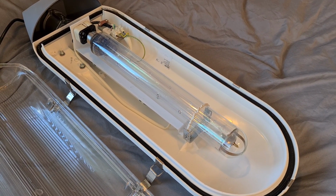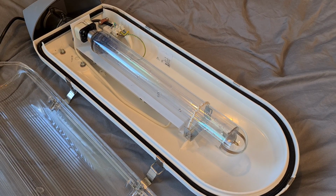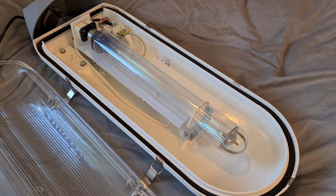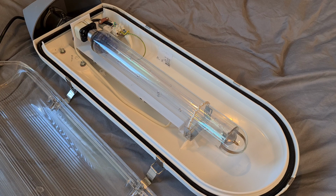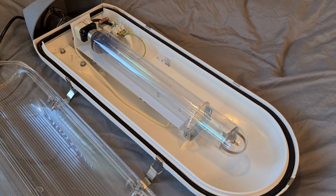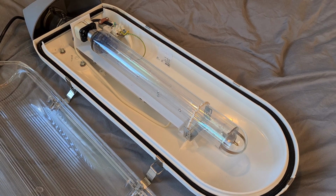There is quite a big variety of bulbs and wattages this fixture has. It's common with low pressure sodium and PLL. The PLL version is called FRS instead of SRS. The smallest version can handle 36 watts, 55, 66 and 90 watt. The middle-sized version can handle 66, 90, 91 and 135. And the biggest one, 91, 135, 131 and 180.